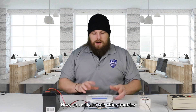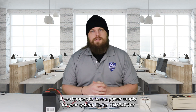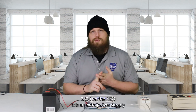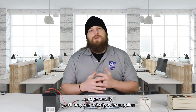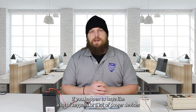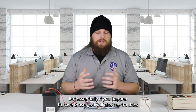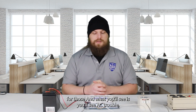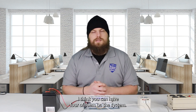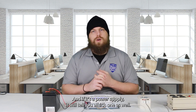You will also see other troubles that will show up under that AC trouble section. If you happen to have a power supply for your system, like an HSM 2204 or 2300 on the NEO, that's an extra power supply that provides additional power for devices on your system — generally only needed if you have a lot of keypads or power devices like motions and glass breaks. If you have those, you will also see troubles for them. It will indicate whether it's the main system or a power supply, and if it's a power supply, it'll tell you which one.